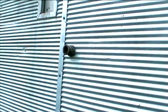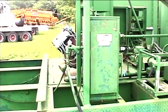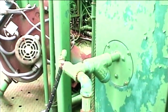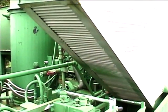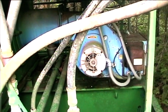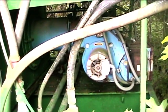Here is what drains on the outside of the unit. This is where the liquefied petroleum is input into the system. It tees off and feeds the Ford V8, then goes into this vaporizer and is piped back to the main burner. This is the main burner — a Power Flame unit which operates the boiler.